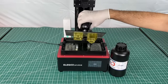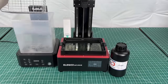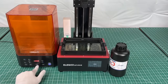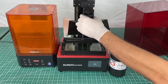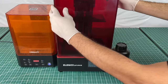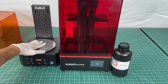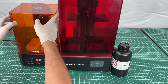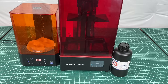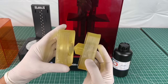We need to wash our molds with isopropyl alcohol, so we pull out our Creality washer and use the metal baskets to throw our mold halves into. We run the cleaning for 10 minutes with this resin. While it's running we reinstall our print bed and cover the printer to prevent any hairs or dust from settling on the resin. Parts are now washed, so we throw them in the curing chamber. You don't want to over-cure these or they can become brittle, so we use around five minutes with this resin. The mold halves turned out really nicely.